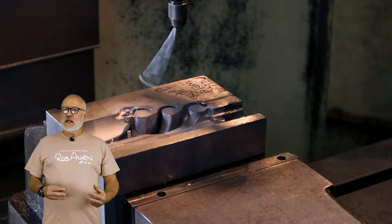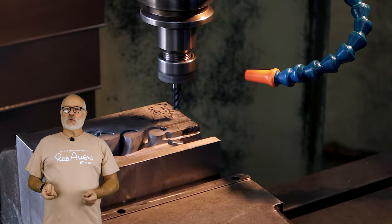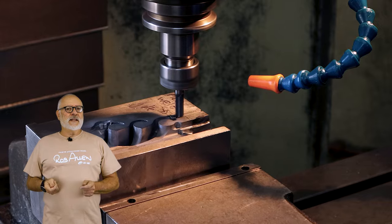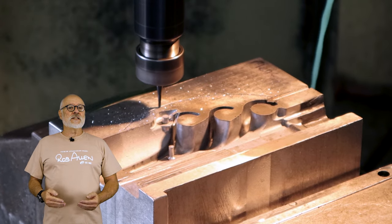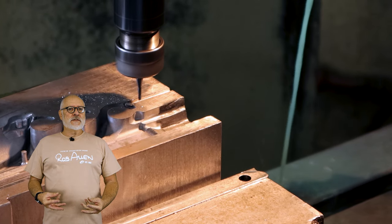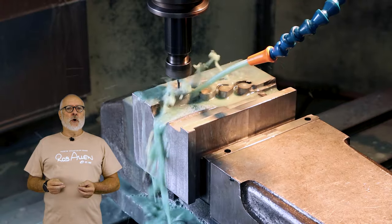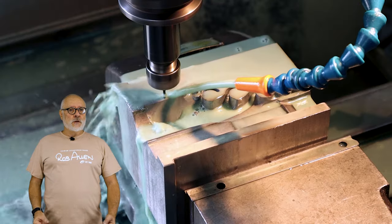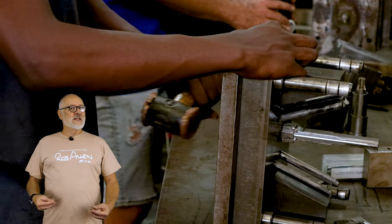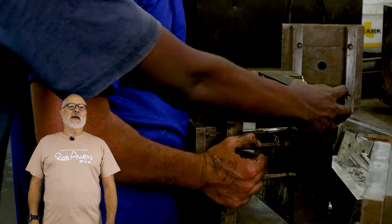The 3D printer doesn't show that — all the dimensions are perfectly stable — but when being molded, the product can warp to some degree. We were aware of this, we anticipated it, we tried to work it into the design, but we ended up with a component that had warped a little bit more than we wanted. So we wanted to take the guesswork out, and we purchased an app to go along with our CNC software to simulate how the product will warp during molding. With that, you input your component and the material you're using, and it gives you a simulated prediction of problems you may have at the injection point. In this footage you can see us closing the old injection point and moving it to where the computer said we should — and surprisingly, the simulated output was exactly what they said it would be. We've since tweaked the drawing to compensate for the minor warpage that would be occurring, and then we got into the water and did some pool testing.